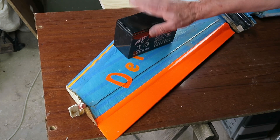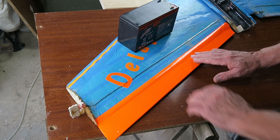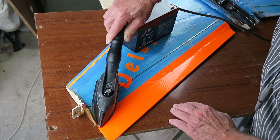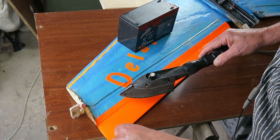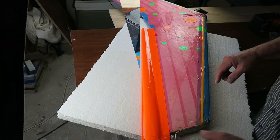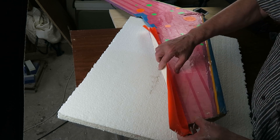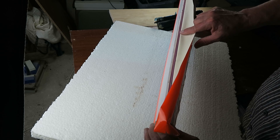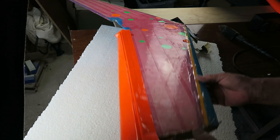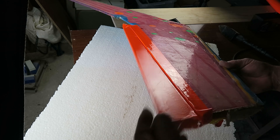It's always a good idea to keep a couple of old sealed lead-acid batteries handy - they're great for weighing things down whilst you work. It's normal to use two settings on the iron: the lowest setting just to tack things in place, and when you're happy you turn it up to the hotter setting. I've cut another piece and with the elevon folded right over I'm going to tack it along the trailing edge and tack it to the other piece of covering film. Okay, it's been 20 years since I ever did this, but I think we have a workable hinge there. Now all we need is the other side.